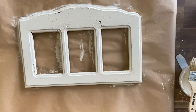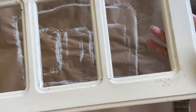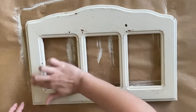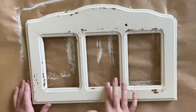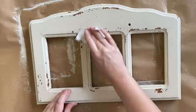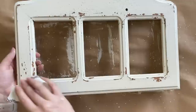Here's a close-up of what we have achieved so far — look at all that beautiful crackle. There's some paint that's ready to chip and flake off. I am so excited about this milk paint. I'm going in just with my finger, disturbing the crackling in the areas where the paint was ready to flake off and gently removing the bits that are loose. Then I'm coming in with some 220 grit sandpaper to get more of that crackle off and to wipe back the areas where the wax is sitting underneath, giving us that really wonderful distressed look. Do this in an area where you can vacuum or sweep up those paint chips because they accumulate quite quickly.